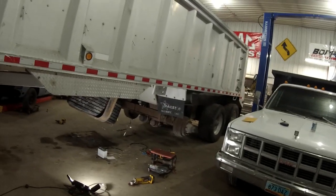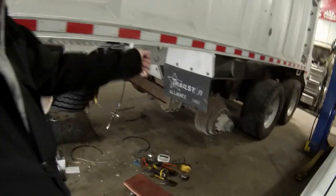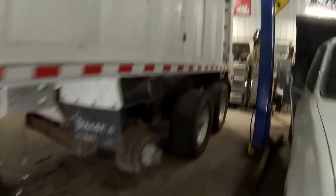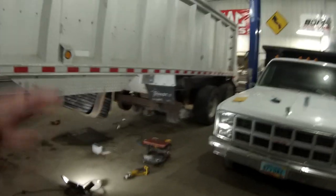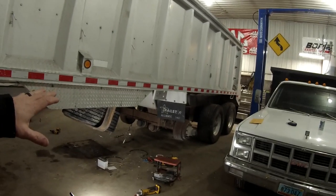What I'm going to do is plumb in all the air system. This trailer had manual air controls to dump the airbags while dumping — because you should dump the airbags when you're dumping this trailer. The airbags drop and the suspension sits on the stop, which makes the trailer a lot more stable when it's up in the air. It also had an air gate tailgate latch control. What I'm going to be doing is putting in electrically actuated solenoids to control all those functions, and adding one for the tag axle.